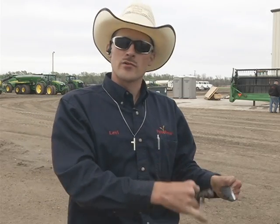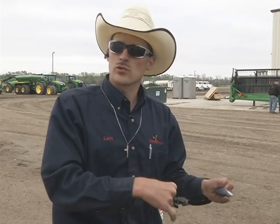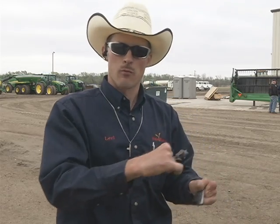On another note, while you're doing this transition from corn to soybeans or back soybeans to corn, I would highly recommend, if you have 2-3 people, to get into kind of a factory mindset where one person does a particular task, like take off the vacuum cover, then the next guy puts the mini hopper pan down and empties the seed out of the hopper and sets the individual plate on top of another of the row units. Then another guy comes behind and removes the brush out, and then another guy comes back in, puts the other brush in, and you just kind of work it out as a team. But it's best if each person has a responsibility for one part, that way you don't end up losing any.